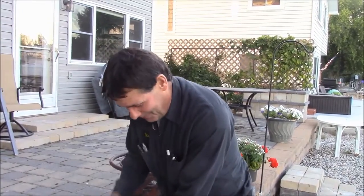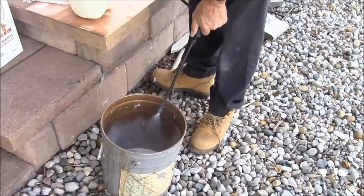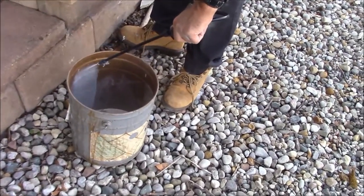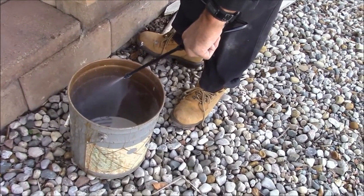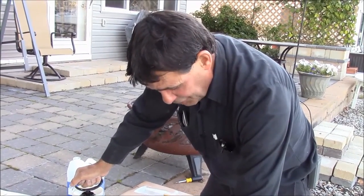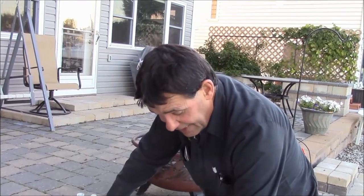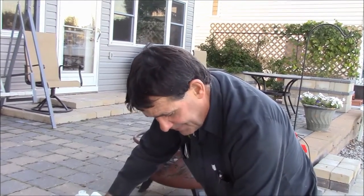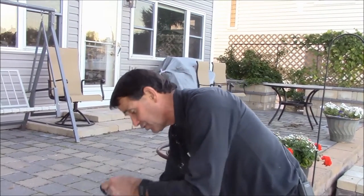There's my second batch of thinner. You're going to see this is getting less paint — here on the side of the can you can see it's pretty transparent, just a little bit of white coloring but not very much. One more dose and this sprayer is going to be clean enough to put away for next time. A lot of times I'll take the nozzle, take the tip off, and put the tip in a little paint thinner in a paint-thinner-safe plastic container for a bit. When I put the parts back together, it'll be pretty much absolutely clean.